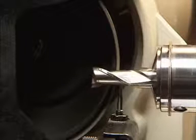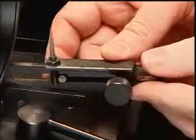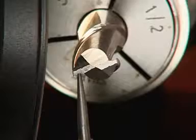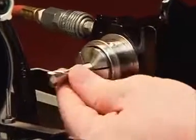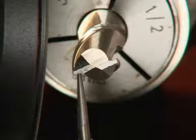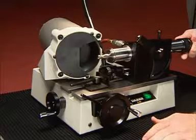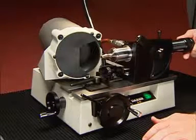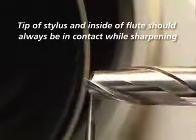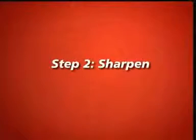Step 1: Set the stylus. As you pull the spindle, the stylus guides the cutting edge following the contour of the flute. With the stylus in the primary position, loosen the size adjustment knob and slide the stylus in or out until it is set in the center of the endmill flute. Each time a new endmill is sharpened, you will position the stylus according to the endmill diameter. Verify the stylus is positioned correctly before sharpening — do a practice run. When the stylus is set in both the primary and secondary positions, the endmill should flow smoothly over the stylus. If the endmill drags as you pull, you will need to reposition the stylus.